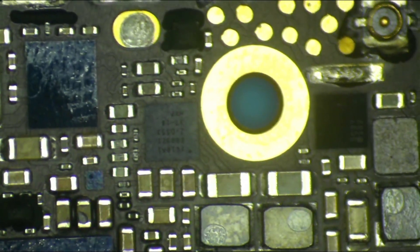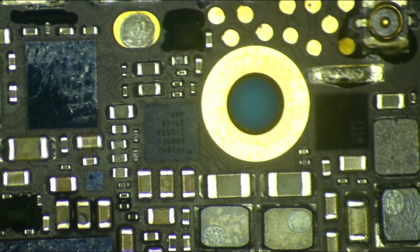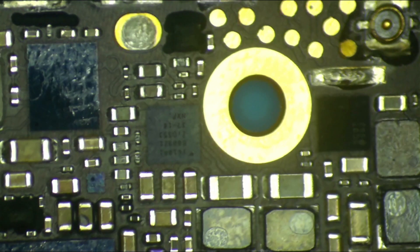So obviously we need to chuck it underneath the scope to begin with, so I can show you guys which IC I'm talking about. And that's that guy just there, which is our TriStar — our USB authentication IC. That's the guy that essentially allows your computer to communicate with the rest of the phone. And then you've also got another USB on there which takes the charge from the battery or charges the battery from the charger. But this guy is USB authentication.